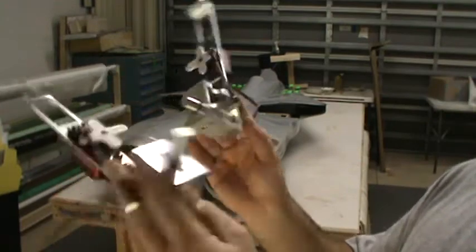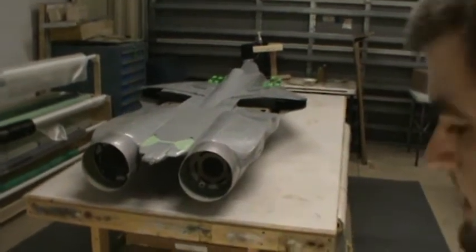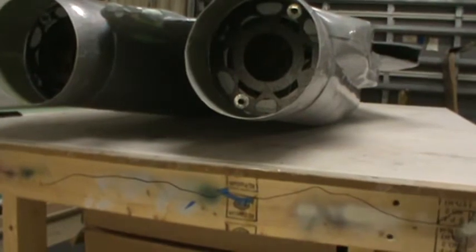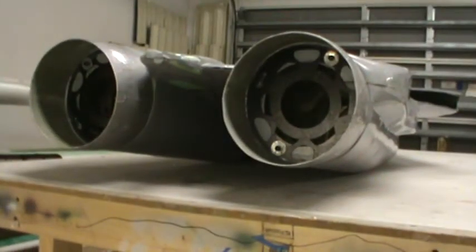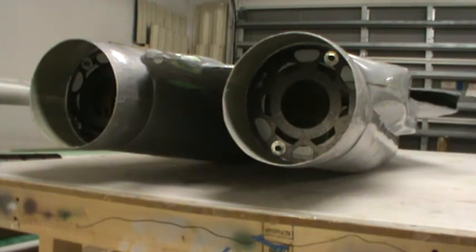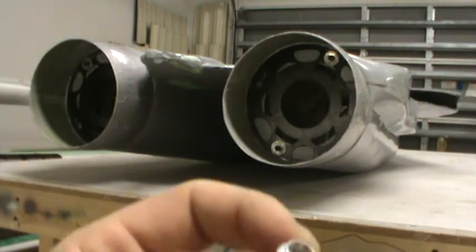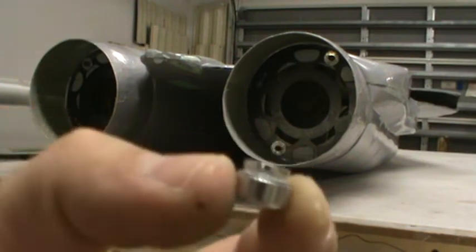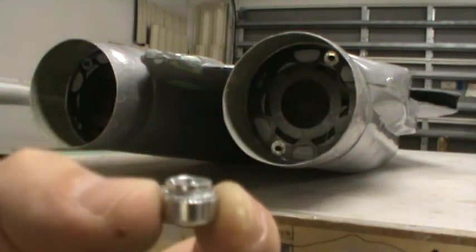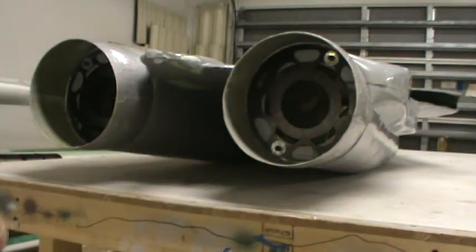To do these I had to pull them out — if I'd had all four servos I would have done this before I closed the molds. The exhaust nozzles are on the thing now. These are pretty close to permanently attached. What it is: I just took some 3/32nd aircraft ply, drilled a hole in the middle, and there are captive nuts and bolts. In the center of that plate I drilled a 5/16ths hole, then shoved these in — the little bell-shape end and knurled portion holds it in place extremely tightly even without glue.